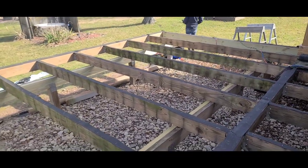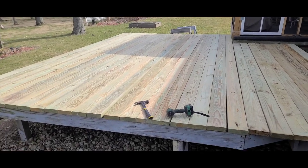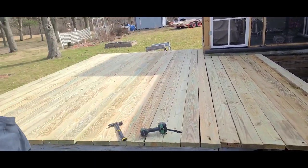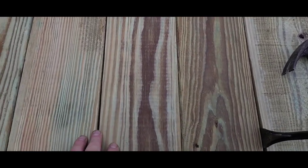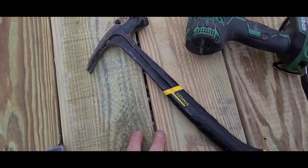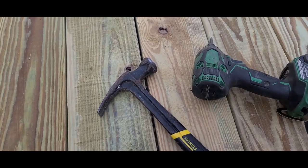That's what we're going to work on next. I just need to space them out and screw them down. They didn't have any gaps but this wood has to be able to swell and contract. I know stuff can get stuck in those cracks, but the water will drain and you can power wash that out. It's much better to have cracks than not with a wood deck.